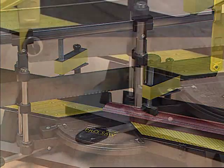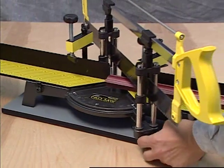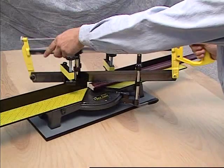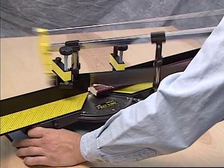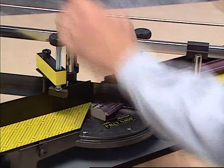For miter cuts, set the angle pivot to 45 degrees on the right side. Do this by lifting the pivot handle up and rotating the angle pivot until the angle block arrow lines up with the 45-degree mark. Make sure that the angle pivot locks into place. Finally, slide the saw down and cut the molding. Accuracy will be improved and cutting will be easier if you use long, full strokes and a seesaw cutting motion. This also helps to clear chips from the teeth of the saw blade.